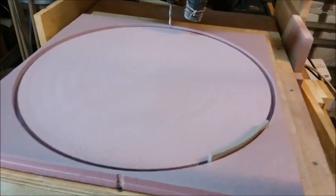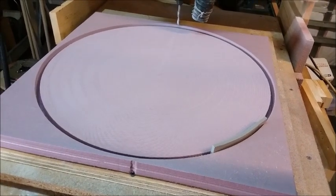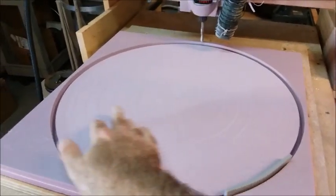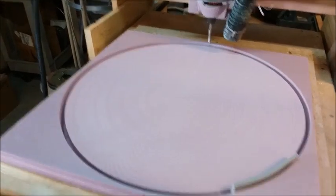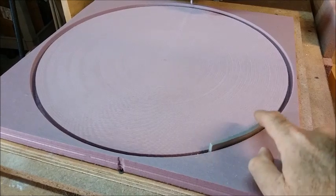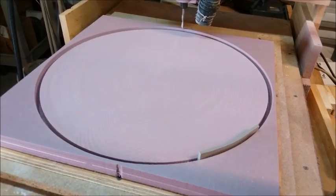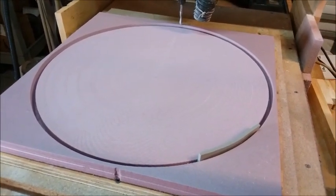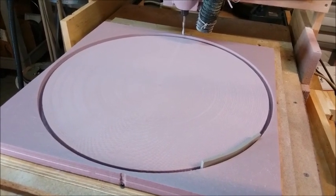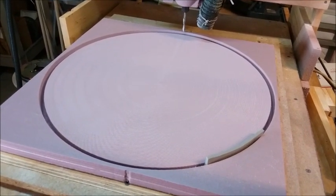What this is is a 16-inch F3.5 slumping mold for making a telescope primary mirror. I've cut a nice deep dish in this foam, and it's got a groove around the edge. I'm going to make a dam around the edge with weatherstripping and pour it full of refractory plaster. Then I'll get a convex mold that I can put in my kiln and slump a 16-inch mirror blank over, to get a fast mirror without a lot of grinding.